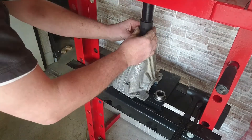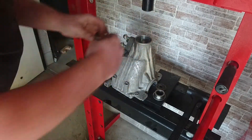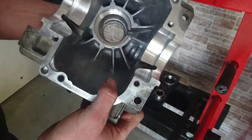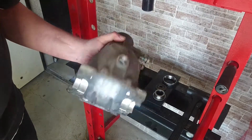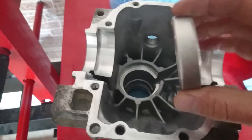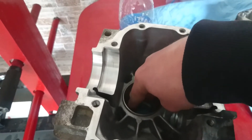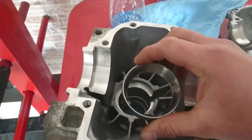That's it. I'll take this out of there - and we're seated. As you can see it's seated from the back too, nicely. Very good. I still have to dial check that with the dial gauge to make sure it's perfectly flat, but my guess is it will be. Right now this side - probably have to do exactly the same thing. Same trick: I got the outer race from the old bearing and shaved it down so that it fits in there, only just though. Very, very close - so that should work. Now I can just jam whatever I like in the middle and it won't damage the race that I'm putting in.